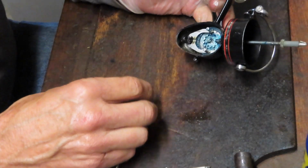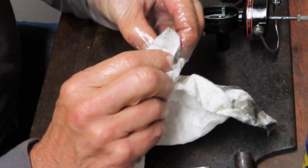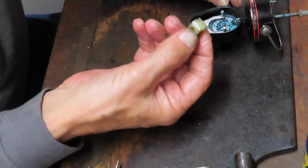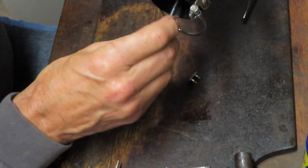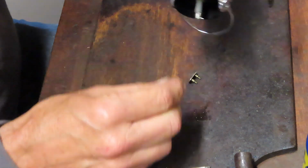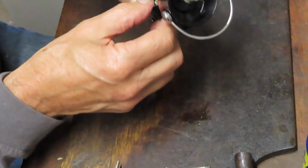And now you want to take your crosswind block. Same thing here, make sure it's clean. You don't want any dirt on there. It's a plastic piece. There are 2 holes. This one doesn't matter which way it goes. Just get it over the stud, and drop down your axle shaft. Find the 2 holes. There's 1, there's 2. Line them up inside, and then our little clip can go in there. That's the hold fast for the operation of that.